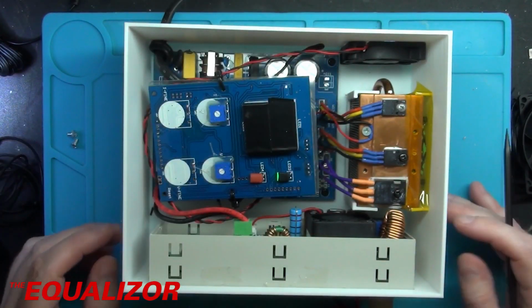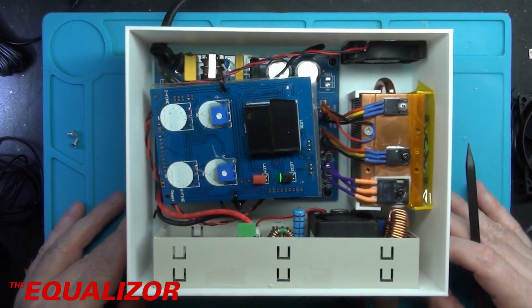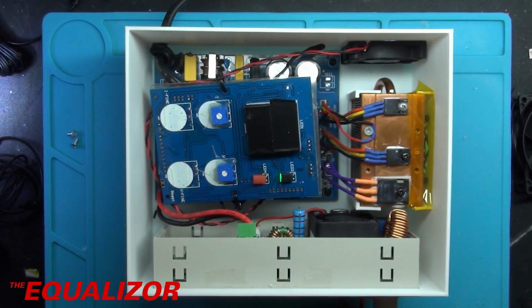It's a really nice little compact power supply, unlike the box that you can get for the RD6006 from the official store, which is massive. That's all very well if you're going to be running high voltage, high current. But for most people, I only ever need up to about 19 volts for laptop repair. Other than that, I'm operating at 16.8 volts, 12 volts, 5 volts, and then lower than that. So I don't need anything lumpy. So that 5 amp 24 volt power supply that I bought should be perfect for this.